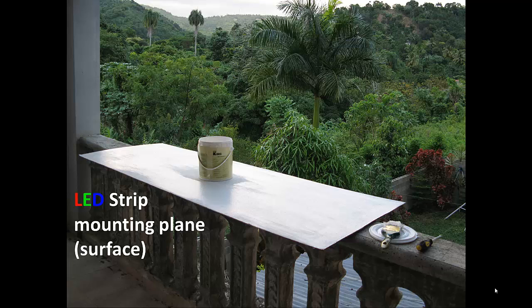Okay, so you built the frame, 2x6, 24 by 72 inches. Now, cut the surface diffuser to the outside dimensions of the frame, the light blending spacer, the frame, and then paint it matte white, and you keep adding coats until it's really white. Depending on what kind of paint you use, you might have to wait a half hour, 45 minutes in between coats. If you don't, it may gall the paint and kind of booger up on you. But you know what's not going to hurt? Nobody's going to see this surface. Remember, this is a diffuser surface.